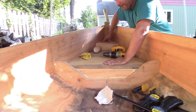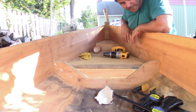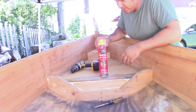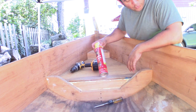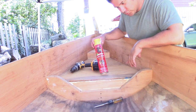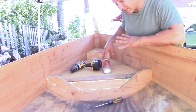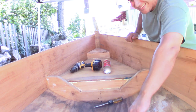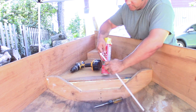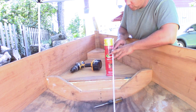The front compartment is finished. I'll drill a couple of small holes and fill it with foam — that's coming up next. I'm going to use Great Stuff, which is a polyurethane foam — basically all these expanding foams are polyurethane. I picked this up from the hardware store. I calculate I have about 1.25 cubic feet underneath here, so one can is going to be very very close. I'll do a couple of holes and to make sure I start filling from the bottom I'm going to use this basin connection tube, which happens to be the right diameter for my fill nozzle, so I can get all the way down to the bottom and fill up from the bottom up.